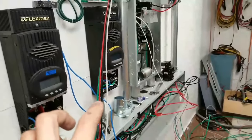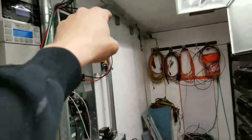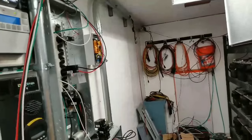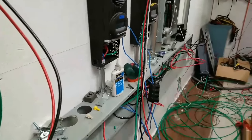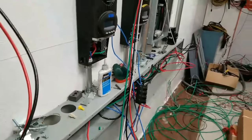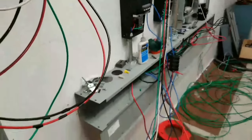I just gotta, in order to get this out, I gotta get these two charge controllers removed, which means that this pipe right here, that's my solar power coming in. I gotta somehow tap these in to keep them up and running, because otherwise I'll kill everything while I remove this gutter, this conduit, this whole thing. Everything you see right here has got to go.